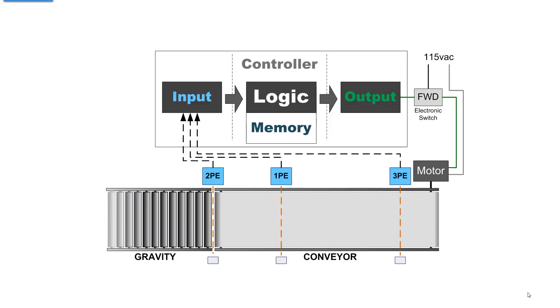I have all of them connected up with some Net ENIs and other interface devices for the MicroLogix units that don't have Ethernet. Up above that you see an L45 that I use for motion control with some block IO, and above that a couple of ControlLogix chassis - plus other hardware behind me that you can't see. Now let's talk about hardware. From the first presentation, we had a controller made up of logic in memory, an input electrical interface, and an output electrical interface. We were interfacing three photo eyes into the input and turning on and off an electronic switch powering the motor.